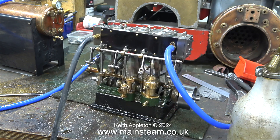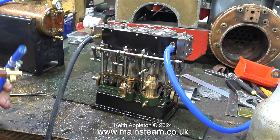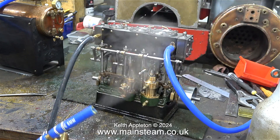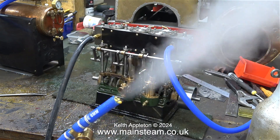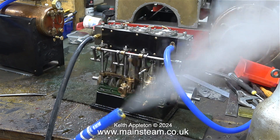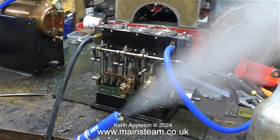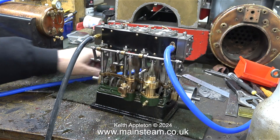You have to do a direct A-B comparison. It runs a lot harder on compressed air. If you rewind the video to the steam section, you'll see what I mean. There hasn't been a fire in the boiler for quite some time, but there's still plenty of steam coming out of the pipe. And in this clip you can clearly see the steam oil coming out with it. Because the temperature has dropped, there is more condensation going on inside the displacement lubricator.